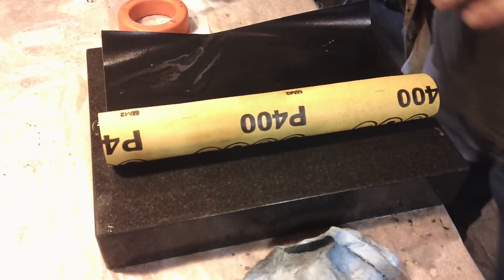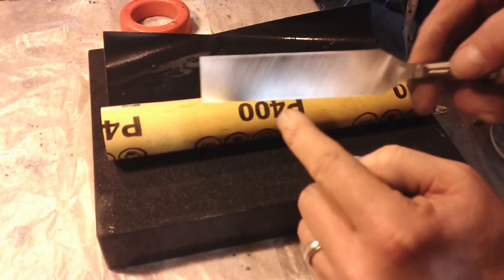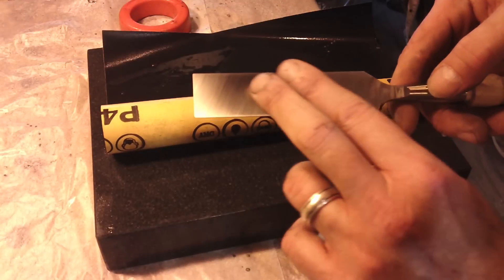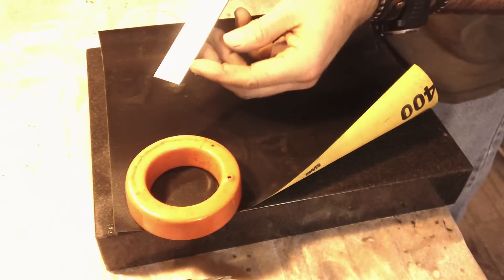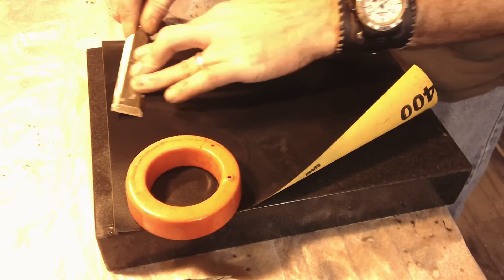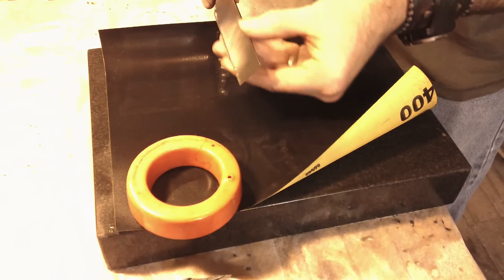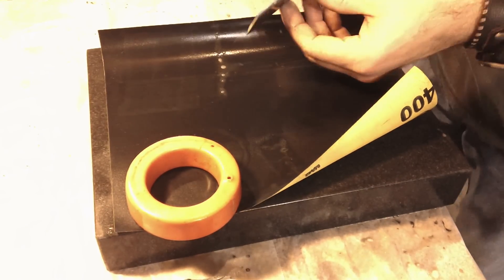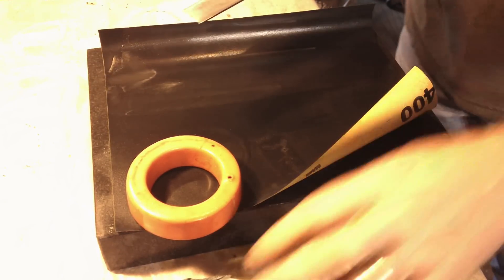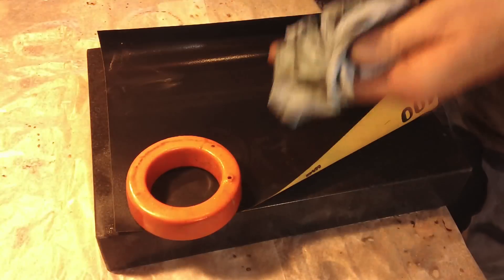I'm on the 400 grit now and I've gone all the way back down to the one-inch mark. They have all had a little bit of a hollow right here, which is good — it eases it up on you to get that front edge flat. After a while they'll get a burr on this edge because this is the edge we're working on. But if you turn them just a little bit, just get a little bit of a round or take that edge off — you won't cut your paper or your fingers. This is a lot of work to get the whole bottom flat, but I want this set to be pristine and done my way, and I've got the time and I'm going to put in the labor.